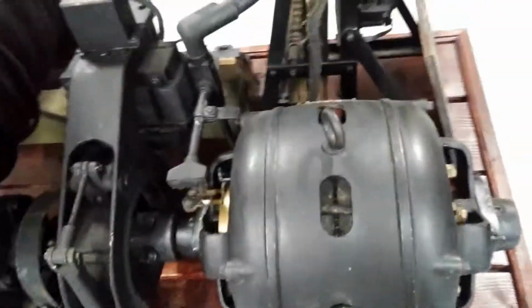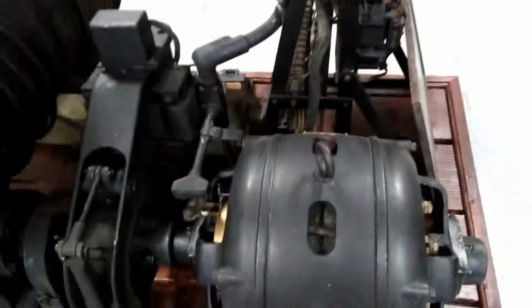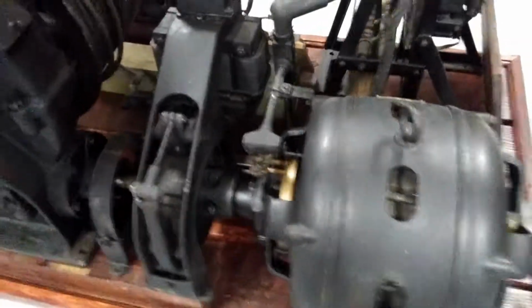Did you miss this? The whole elevator machine right here. That's the elevator machine usually found one floor above the top of the elevator. Well, this one's actually in the basement. Yeah. There's the floor. Usually this one's backwards, as it would be in the basement. Rowan, how does the floor selector work? It moves with the elevator, and then it hits these switches as the elevator goes up. Okay. And it tells the elevator when to slow down? Yeah.